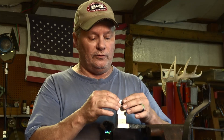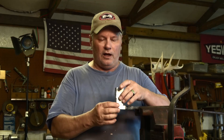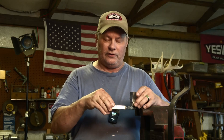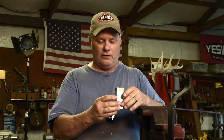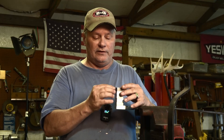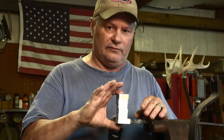I like to be very clean and make sure I get a good forge weld. Then I'll stack them up and we'll be ready to forge weld them. After I get them good and straight I'll clamp them together, and when I stack these up I rotate each pattern. So this is the initial cut for this first one, and I just flip it like this - that way this cut matches that cut. Then the next one stacks right on top, flip the next one, and so on. That way my patterns somewhat match up. It doesn't matter a whole lot about alignment on a feather, but if you're doing a mosaic you need to take your time and etch the ends of every piece.